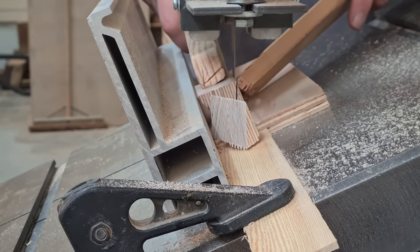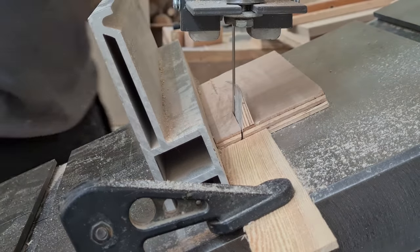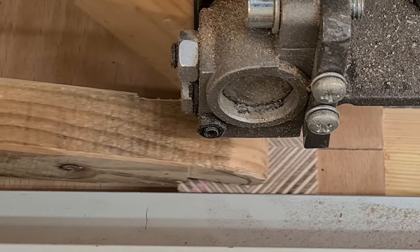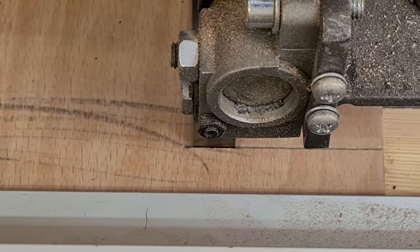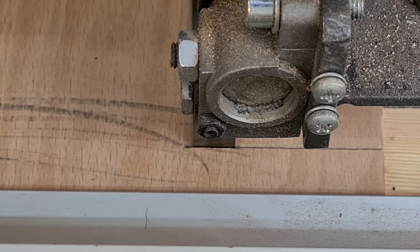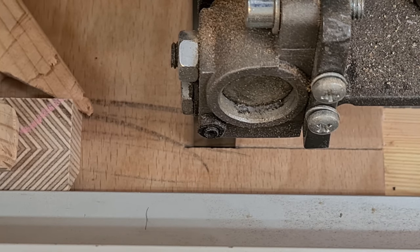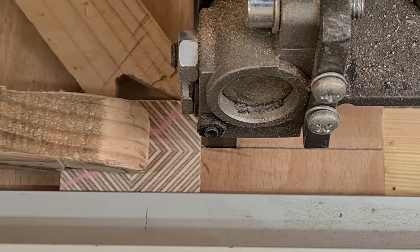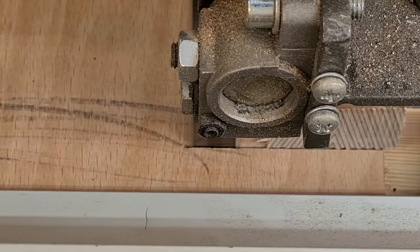To obtain eight segments into a ring, each side was cut at 22.5 degrees. I did a very light sand in order to remove the tool marks, and then did the gluing. If you ever want to avoid problems in cutting segment angles, I always recommend cutting scrap pieces that are the same size as your good wood, and this will avoid losing a lot of material.